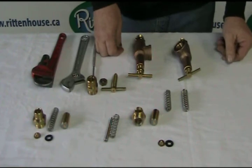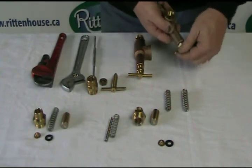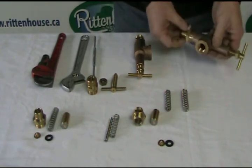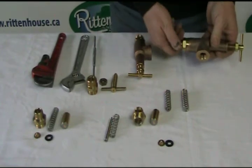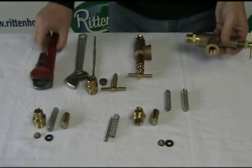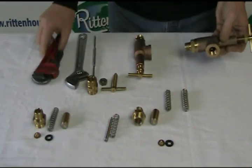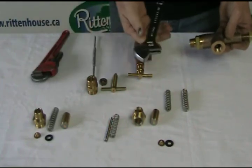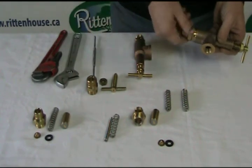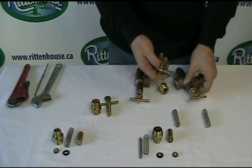So we're going to show you how to take care of this problem. First thing we're going to do is back off the T-handle. We'll take the nut off the bottom. Generally you need a nice adjustable wrench and a pipe wrench. Take the pipe wrench to hold the body and then use the adjustable to undo the bottom end here. And take out the internal components.